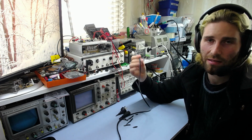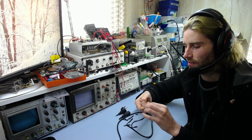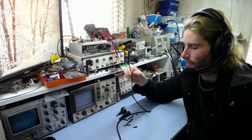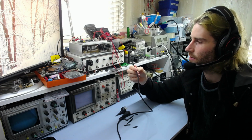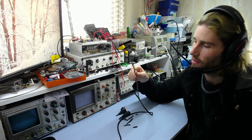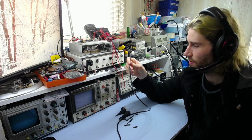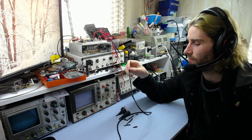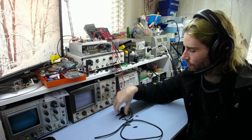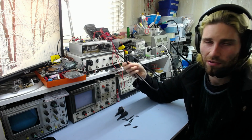You could get 3 of these, and if you paralleled all the strands from all these conductors together, that would give you 1 cable, and then do that with 3 of these, and you could use each of these for each pin. Then you'd at least probably get the power rating correct and the thing wouldn't catch on fire. But unless you're in a really desperate situation like that, just no. Best thing to do is just cut the plugs off, cut this up into little pieces and throw it away. It's not worth it.